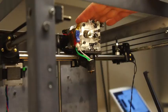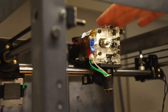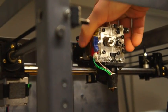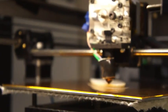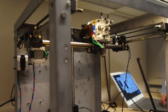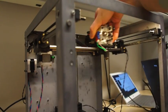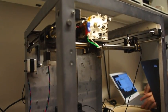The most important part of the printer is the extruder. This is an extruder, also called the print head. Imagine this is a hot glue gun — a computer-controlled hot glue gun. So the extruder is going to move around in three dimensions and lay down a hot layer of plastic coming out of our nozzle. The nozzle is 0.35 millimeters, a very fine nozzle — it gives us very good resolution. And the extruder is just going to move around in these two dimensions here and draw one layer at a time.